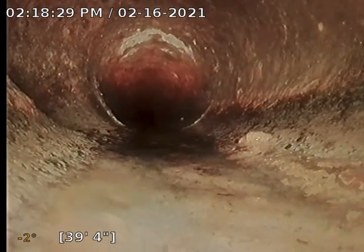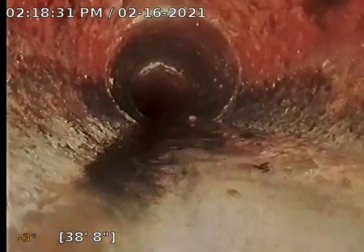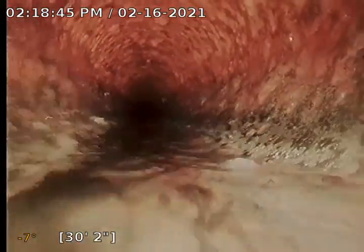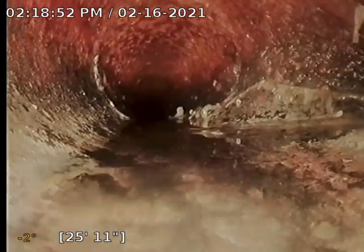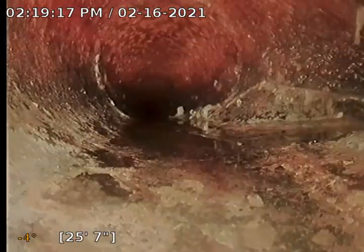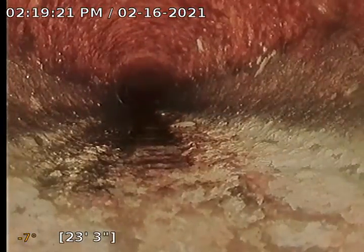I've located that about 10 feet off the building. I did not find an easily accessible clean-out. They have just put bark dust down so it's probably either covered in bark dust or buried under the ground. I'm located about four to five feet deep. Here's the other connection point — we're going to pause and locate. I'm just marking these points so I can see if I can find another access point. That one's for the duplex tie-in.